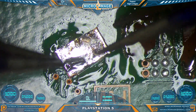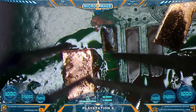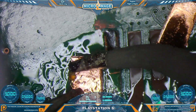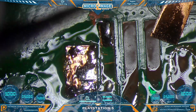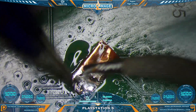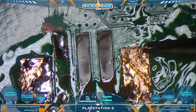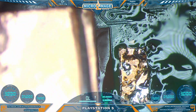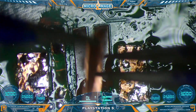Nice even coating on it. Flip it over, and be very careful not to make contact with this area — those are two different signals. Going ground. Adhesive works against you sometimes. Here, I'm not using copper tape for the adhesive. I think this ends up being so much more solid. Next one: add the flux, some solder, and tin our pad. Flip it over — our typical fight with the adhesive. Get it in place. All this adhesive will come off during the cleaning process; the alcohol will take care of it. Now we need one more ground — thin, but not too thin. I think we did pretty good there.